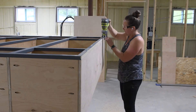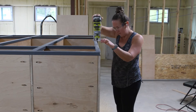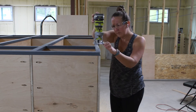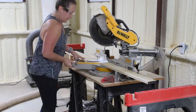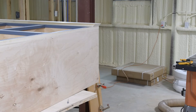I used a flush-cut router bit in my palm router to flush up the side of the cabinet. Because I was flush-cutting three-eighths of an inch, I did it in multiple small passes so that I did not break or tear out any of the wood. The final piece of the cabinet is adding a base — this covers up the bottom and brings the cabinet up off the floor just a little bit, which I like so I'm not leaning down as much.